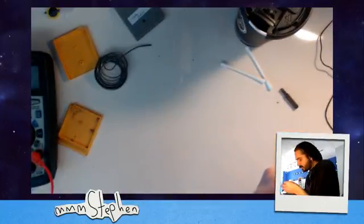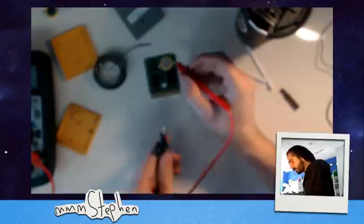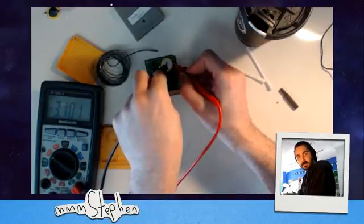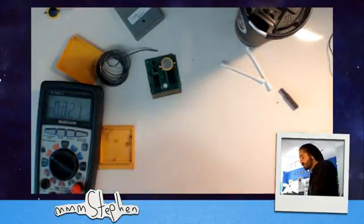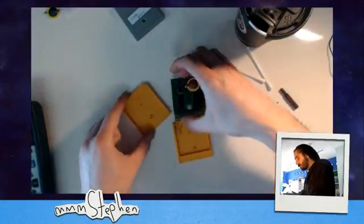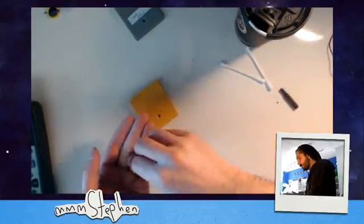So yeah, this battery totally worked. It's weirder than the usual batteries I order in. It's a little bit bigger, but they come in varied sizes. It's just the little frame that's the important part, because you can't solder directly onto the nickel these are made of. The solder just balls up. Also, it's not a good idea to solder onto a battery anyway. It could explode. But yeah, there's our Pokemon Yellow back in business.